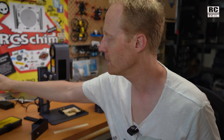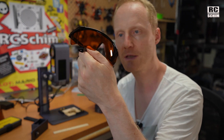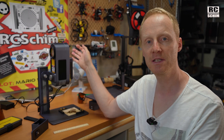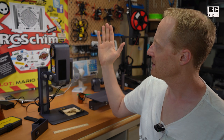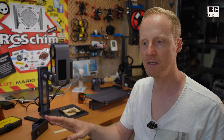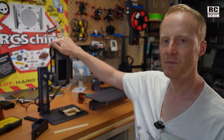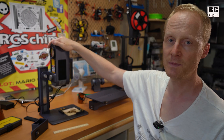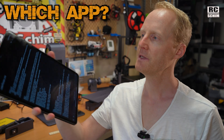When you remove the shield you need to check a disclaimer, go into what's called free mode, and then you can operate without the shield — but you always have to wear protective goggles. It's not idiot-proof; giving this to kids could result in eye damage or worse. But it gives you freedom to do a lot. On my other laser engravers, opening the enclosure stops it immediately with sensors. It's a downside from a safety perspective, but also a plus for versatility.